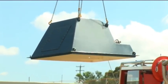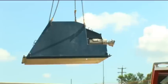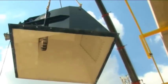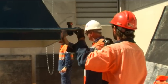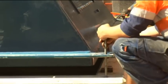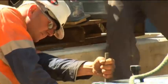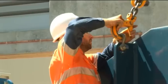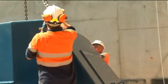The turbine is now in position, ready to be lowered down over the pit where it will be located on some jacking bolts, and we'll sit it at the right height to make sure everything's all good. We're using some locating pins to make sure all the holes align, which also helps the lowering process so the jacking bolts align with the correct spaces in their correct positions. The turbine has now been correctly placed and everyone's happy with the locating pins and jacking bolt positions.